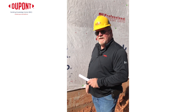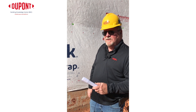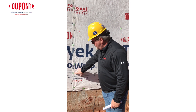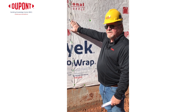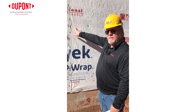One of the things on the job site that your inspectors and third-party inspection companies will catch you on is when they see tape over top of a cap fastener. You can see this in multiple places here, and what that does is give you an opportunity for water to migrate in and get to the fastener. We really don't want to do that — we want your fasteners about six inches away from any seam.